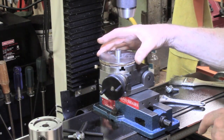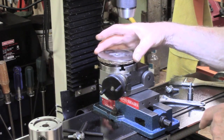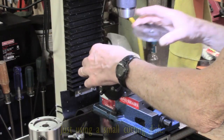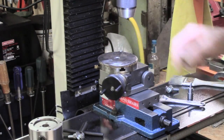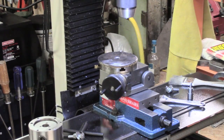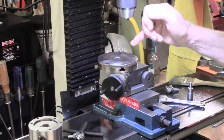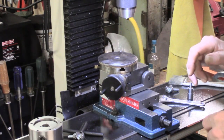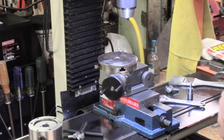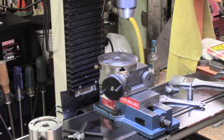So I'm going to prepare the plate — probably just a simple grinding job, certainly enough for the moment to get this fixed onto the turntable. And then I'll probably use a centre drill; I think I'll get my three holes and after that I should be good to go in the drill press, or setting it up on here differently. I just want to get the first positions accurately.